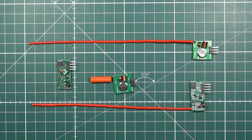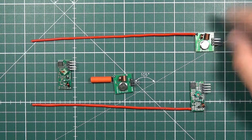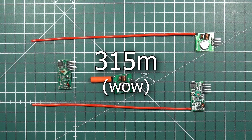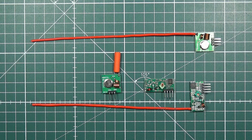The results are impressive, and I'm really surprised by how well these tiny modules — a pair of which costs maybe two dollars — actually perform. When I was using them previously around my apartment or home in Poland, I was almost never able to reach more than a few dozen meters. This time: 315 meters. But remember, this is open space with almost no interference, and most of the time both transmitter and receiver were in line of sight.